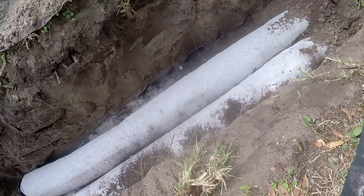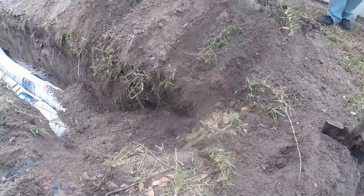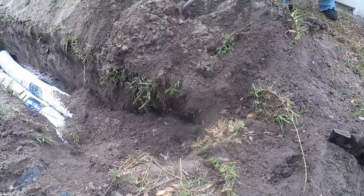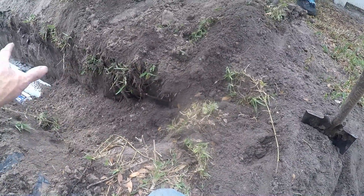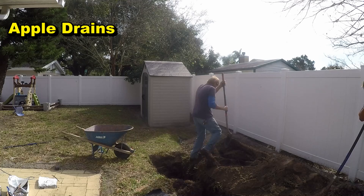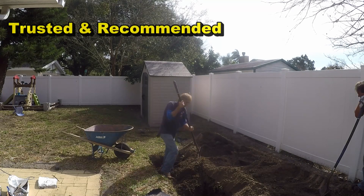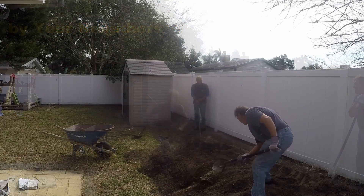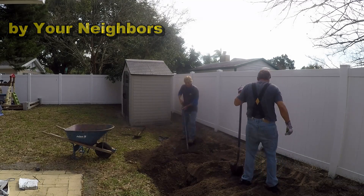That water is just about gone, so we're going to go ahead and start to backfill and cover up the rest of this trench. You can see you just push your soil back in, and it's going to be a little mound about a foot high the whole length of the trench, but that will settle as soon as it starts to rain. Remember, the real problem here was that the chamber no longer functioned — water came out from the washer, filled up the chamber, but it could not leach down through the soil, because the soil had become packed with phosphates.